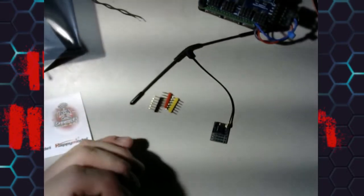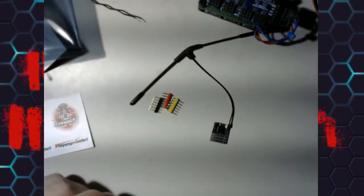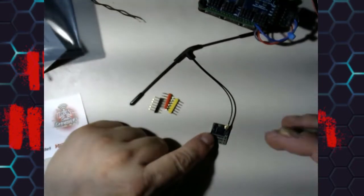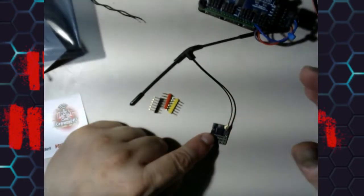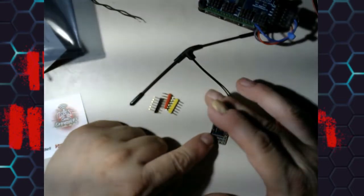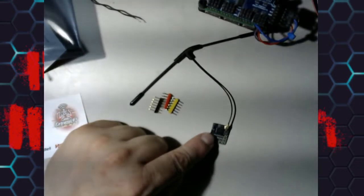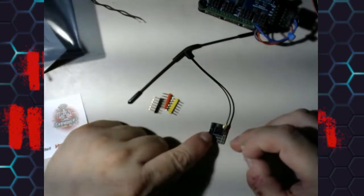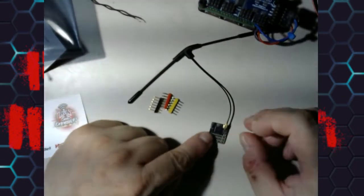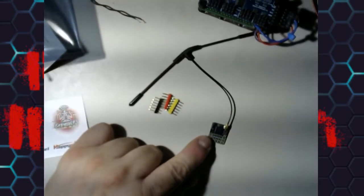But just having these PWM channels gives a lot of room to grow. So I'm going to have to solder these headers in here now. Back to that problem people are having with it being in constant boot mode on some of them. If that is an issue with the firmware being corrupted or missing, because it's staying in boot mode constantly, you might be able to repair it by flashing it over the UART, which would involve using any of the power and negatives and channels 2 and 3. Now, when I've done this in the past, I've had to switch the RX and TX to what it suggests on the HappyModel website.